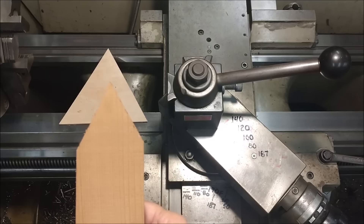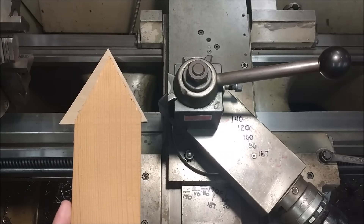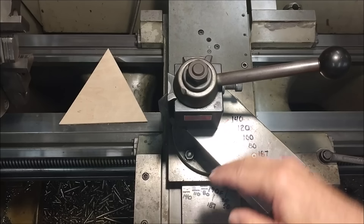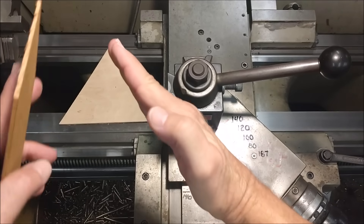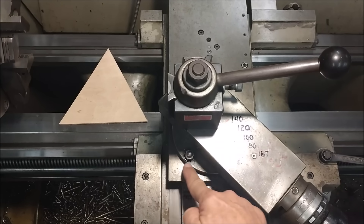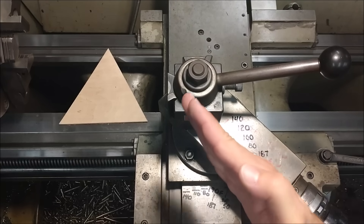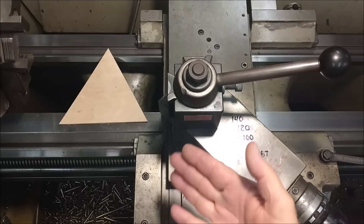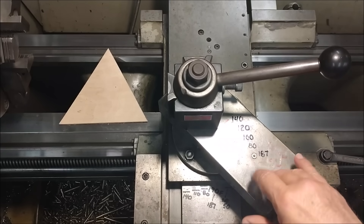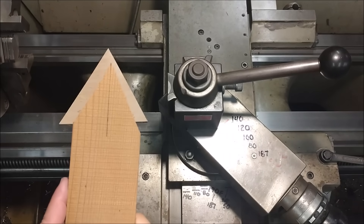When you align them, the tool is going to move with the compound, so your tool must also be perpendicular to the axis of the machine — perpendicular to the part. That's all I want to express on this one: the lead screw, or the side of the compound, within that 60-degree projected boundary from the thread profile. I don't care what the little scale says — sometimes it'll read 60, sometimes 30. Go with the physical setup. Ignore the numbers at first, but then look at them so you know what to look for next time.